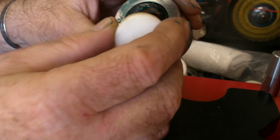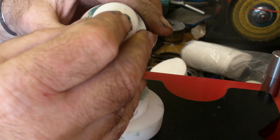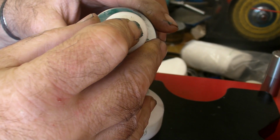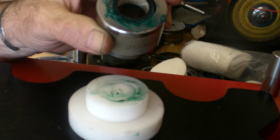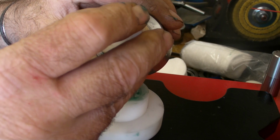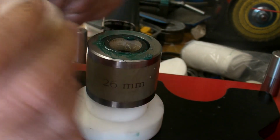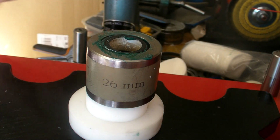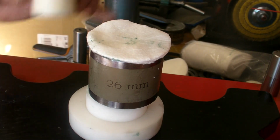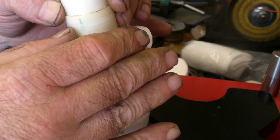You get a rod that is suitable. Now that's not suitable. You see, you might get away with it, but if it goes wrong, it's going to be disastrous. So that's not suitable. You need to completely cover the reed. Now that's perfect for the start. They won't last very long, so I've only got one push on that. But the thing of it is, better to be safe than sorry, because I've had a couple that go through.